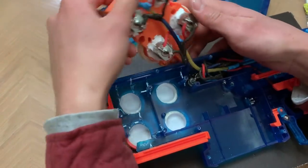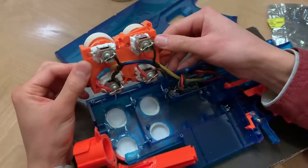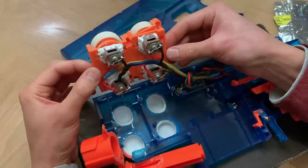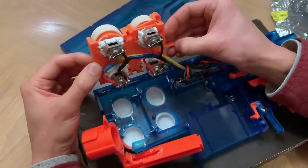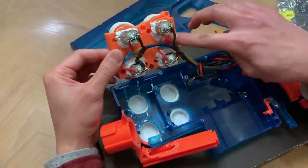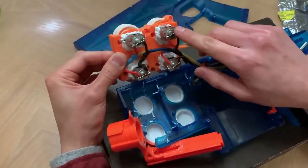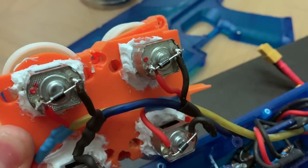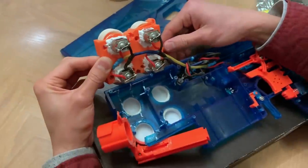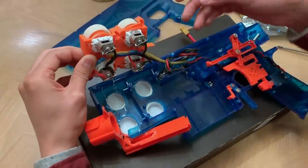The motors are 180 motors — just generic Chinese 180 motors — but you can use whatever motor you feel like. These should be spinning at around 45K RPM, so pretty fast; look for eclipse-level speeds. All the goop around here is just for extra silencing, because at two stages that's going to matter. These right here are diodes for your motors — just make sure your MOSFETs stay nice and happy so you don't blow them. I solder them right across the motors, although a lot of people solder them across the MOSFETs.